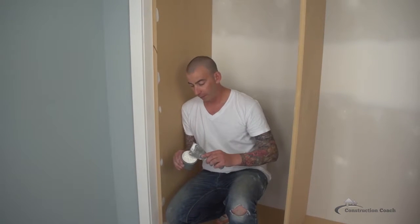Just at the last of my nail holes to patch up. Nail holes and damage that you're fixing with wood filler always needs two coats as a minimum. Very similar to drywall screws. I like to do 2 to 3 coats over the nail holes or deficiencies. And then when I do spray my paint on top of it, if I still see it through the paint, then I can add another coat of patch to it. So minimum of 2 times on all the nail holes and deficiencies.